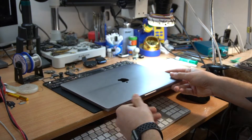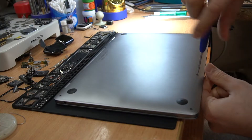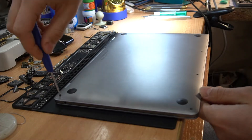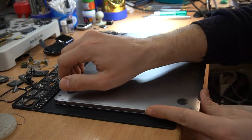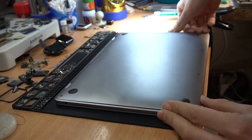Still, it's not a reason for the flex cable to be damaged. All the older models didn't have this kind of issue because instead of a flex cable there was a regular cable which was more durable. In the newer models there are two backlight flex cables that connect to the main LCD board and then connect to the main logic board.